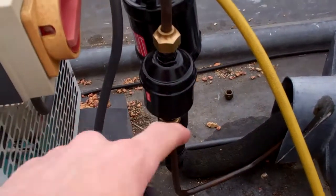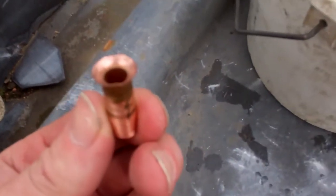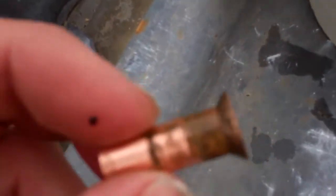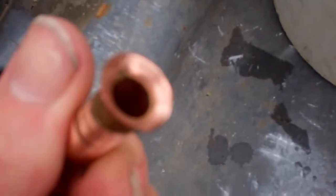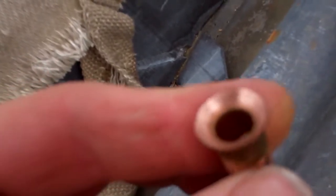We're going to get this cut out and linked out. If I've got another sight glass I might put another one in there because that one is pretty dirty, and then a new dryer in there. I was just looking at the quality of the flares on that dryer - it's got a great big scratch in it at about 12 o'clock, and the edge is all crinkly looking. It does make you wonder how the guy passed his F-gas assessment if that's the quality he's working to. There's just a bit of a tide mark in there, which is worrying.